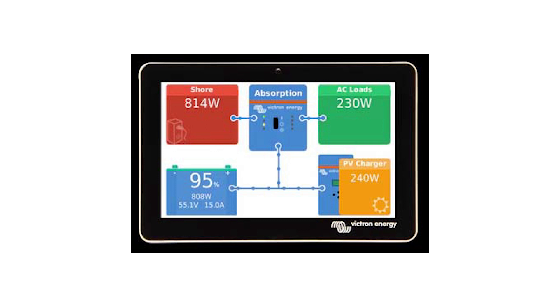That instrument gives you a really nice view of what's happening on your boat at the moment — what's happening on shore power, how many watts you're pulling, what your AC loads are, how much is going to recharge the battery, battery voltage, amps going in. You can connect your solar controllers to this device and see what each solar array is doing, your aggregate solar output, and the amps. On top of real-time monitoring, you also have historical data to establish trends and see patterns.